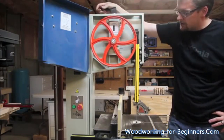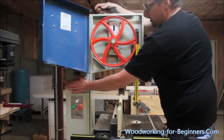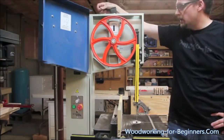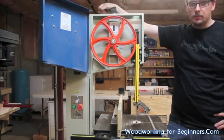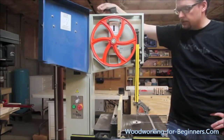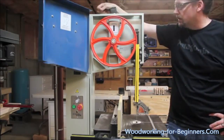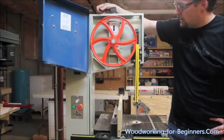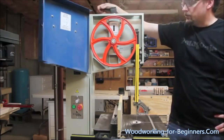The saw construction itself has a super heavy column on this side, so I really have no reservations. If I put a carbide blade on it — something that requires really cranking up the tension — that column is going to give this enormous beam strength and keep really high tension on those blades without issue. Just another example of the real heavy construction.